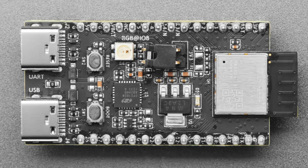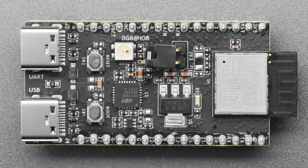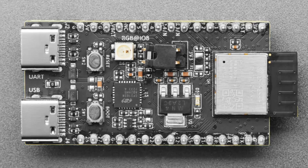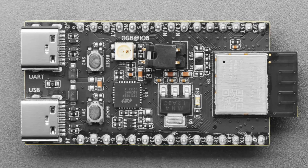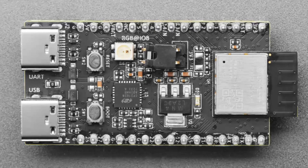So I think probably this is designed to target things that are going to run Matter or Thread or other Zigbee, Bluetooth, 2.4 gigahertz non-Wi-Fi communications for home automation. It'll probably be a good competitor to the ESP32-C3, maybe lower power use. And so far, Bluetooth on Espressif chips hasn't been their priority compared to Wi-Fi, so it's going to be good to see them focusing on Bluetooth, maybe getting low power usage for Bluetooth with better, lower numbers.